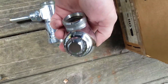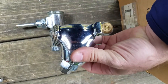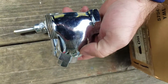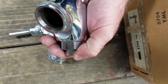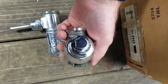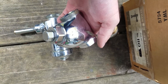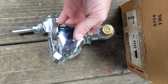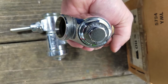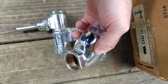This here doesn't go with these valves — it actually came with this lot. This is a Sloan control stop, but it's a straight stop, not an angle stop or 90-degree angle. You don't see these very much on exposed valves; sometimes you'll see them on concealed valves. You can still get them with exposed valves — the Sloan model 100, if you buy a Royal 100 for example, it'll come with this straight stop. It's kind of a rare application, and this is actually not new because it says 'quiet flush' on it, so this thing would have to be from the 60s probably.